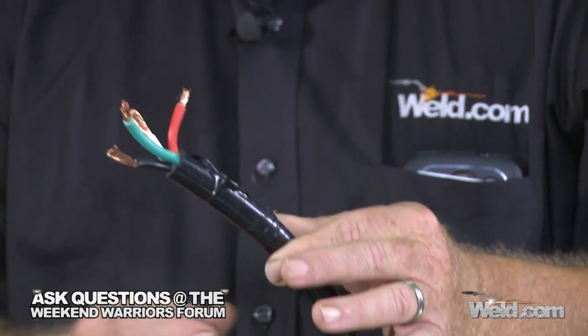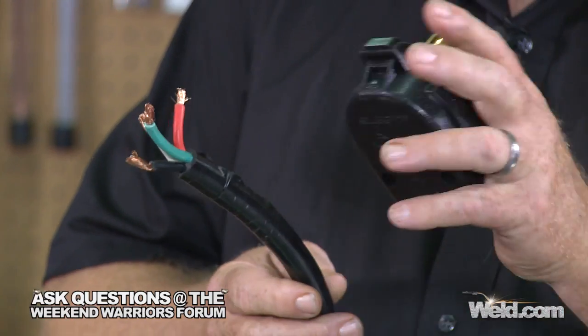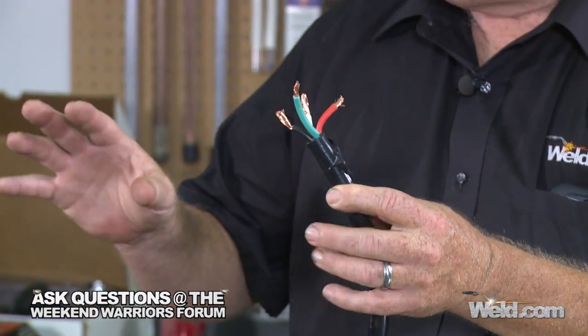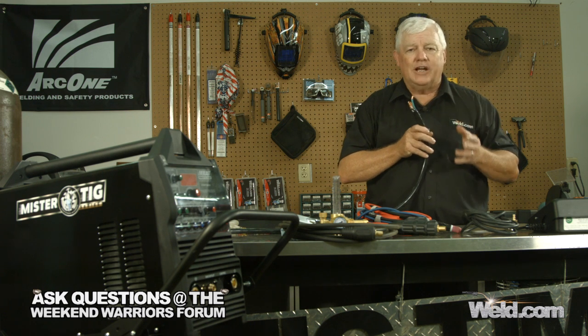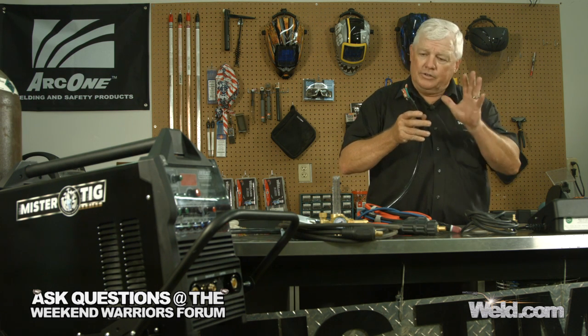It comes with four wires sticking out. We don't like for you to have to plug this in or do any pre-wiring. What we want to do is take a plug and put it on, so when you buy this machine it will already be installed. The reason it comes this way is because it's a single-phase and three-phase machine. Industry will probably go three-phase, but this machine 80% of the time is going to end up in your shop and you're going to want a 50 amp plug on it.